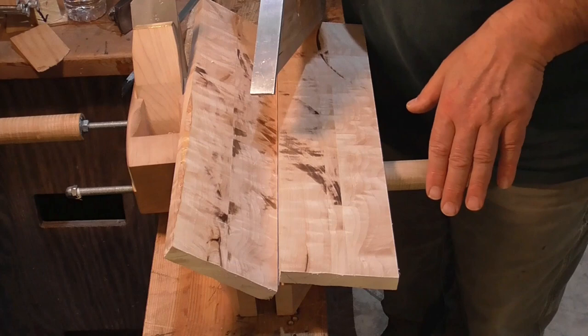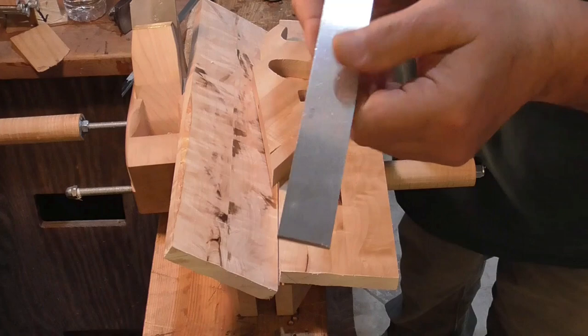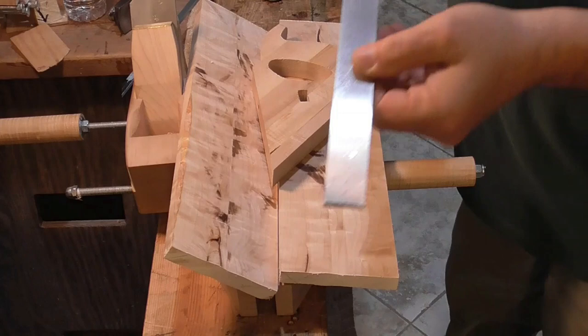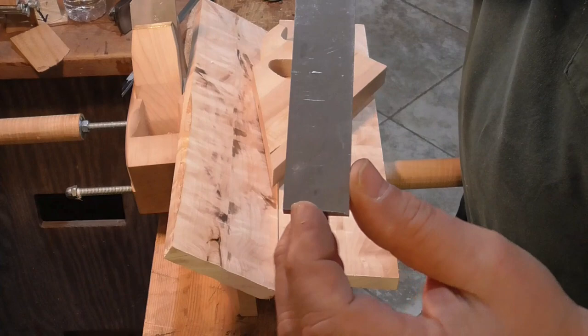the left side of the plane, and I'm going to create a small shift in it so that the blade doesn't come just to a point. There's actually going to be a tiny whisker on the other side, so the point of the blade will be about 1/8 of an inch from the right hand edge of the blade. The reason I'm doing that is because it's going to be easy to fabricate the blade, and also probably it will be stronger, because rather than the blade coming to a point, it'll have a little bit of mass behind it, so the cutting corner will be just off the side of the blade.